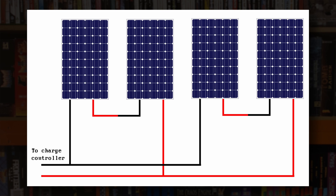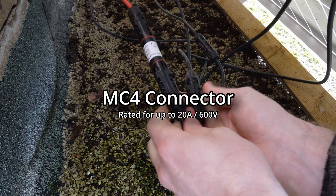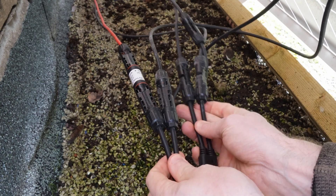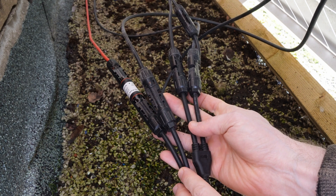The solar panels are wired together in two banks of two, and with them being 12V panels that means I'm running a 24V system. The benefit of this over 12V is that there's only half the current running through the wires, which is safer. And also, as my batteries are 12V, it should be more efficient as far as the charge controller is concerned, as it has that overhead to work with. They're all wired up using industry standard MC4 connectors and 12 AWG wire, which is what came with the kit. That should be safe for up to 20A of current, which happens to be the absolute theoretical maximum that this setup can put out.